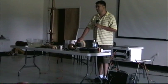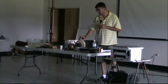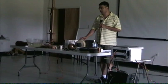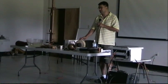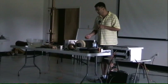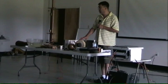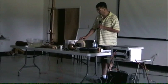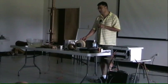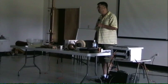The funny thing is that everybody does that — nobody treats the coil. In his book, he dedicates about a whole chapter on how to treat the coils. I'll summarize it into two steps. First, wind it in a paper form — not plastic, use paper that can absorb wax. Second, put it in a vacuum chamber at a moderate vacuum of 29.5 inches of mercury. Then heat the device up to at least one-and-a-half times the melting point of the wax, introduce liquid wax into the vacuum, and then apply 30 psi pressure onto the coil while the wax cools.